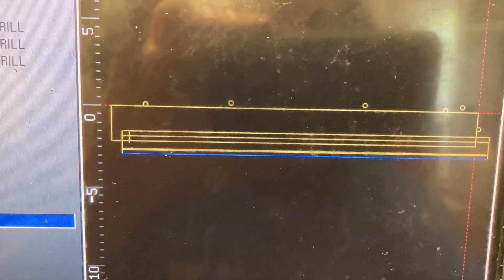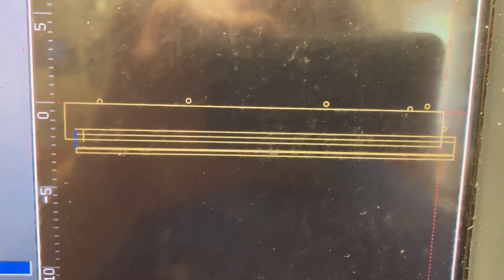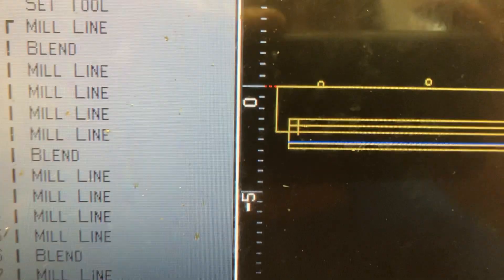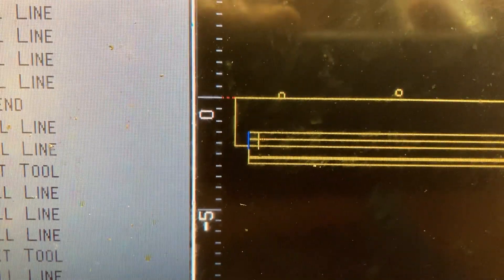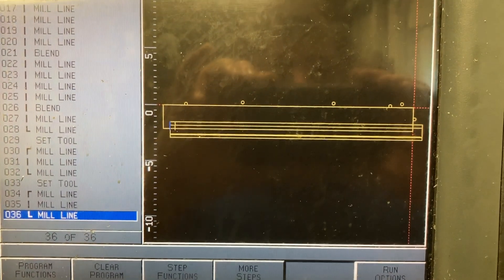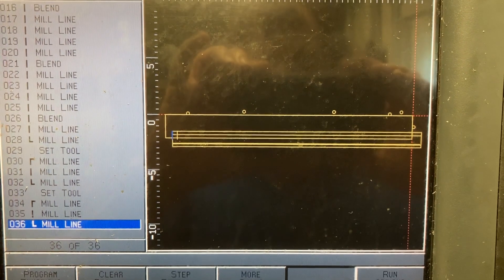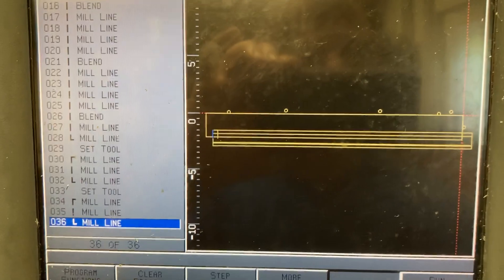This right here shows me the outside profile of the piece so I can see when I'm milling and calling out the programming if it looks like it's laying out where it's supposed to. Down here's where I actually start - it's using a half inch tool. You can see the rough pass walks off the part, rapids back, another rough pass walks off the part, rapids back, finish pass. The graphics are pretty nice - when you draw it out and program it you can see what you're doing. If you make a drastic error you see it right away, and you can watch the tool path, see where it's going, how much overlap you're getting.